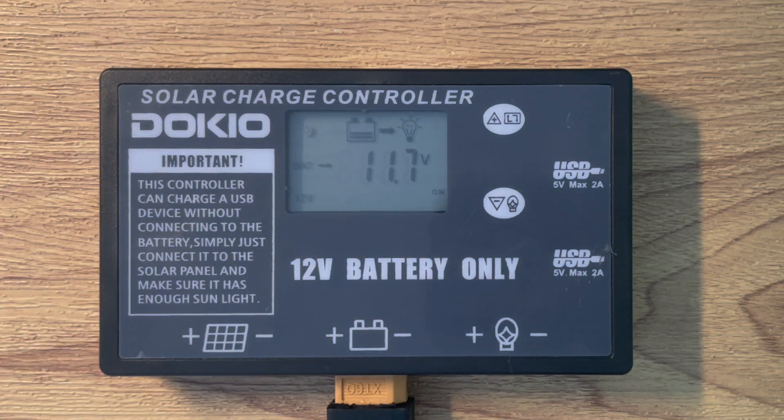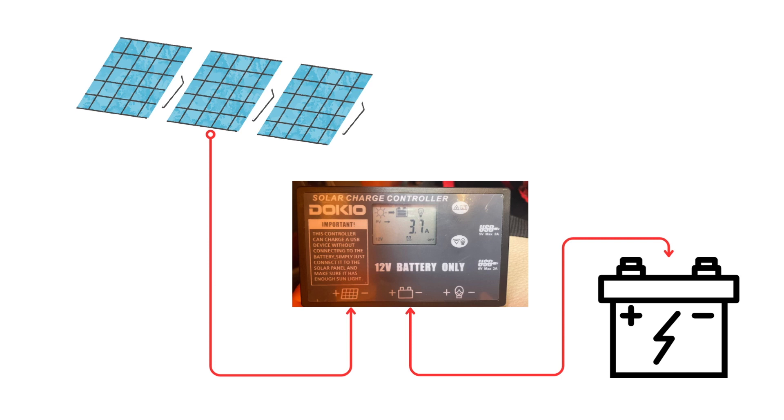So how does that work in practice? Here's our setup: we've got a solar panel, a charge controller, and a 12 volt battery. We've been using a few electronics on the boat and our battery is now at 12.5 volts. We plug in the solar — that starts out at 18 volts until the controller connects the two together and drags the solar panel down to 12.5 volts. The panel is now trying to lift the battery voltage as it charges, but in doing that the 180 watt panel is no longer 180 watts because it's not delivering at its maximum voltage. As the battery starts to charge this will improve, but depending on how large your battery bank is, it could take a long time before you're getting maximum performance out of your solar panel.